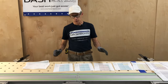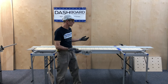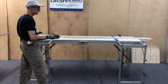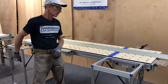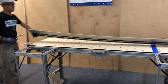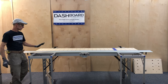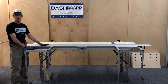Now we'll explain the system. Since we're going to start by doing all the longer rips to separate the pieces on all these sheets, I've got the basic bench set up for long rips. This is the bench itself. We have some track stars arrayed around the table for different purposes, and we have two outriggers set up for support of the four-foot-wide sheets. One of the things track stars are good for is using with a long rail and some of our spiral dogs.